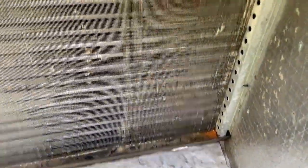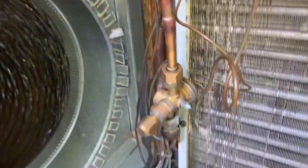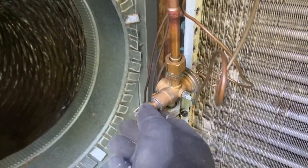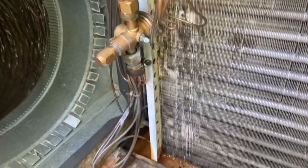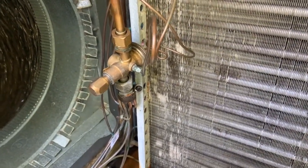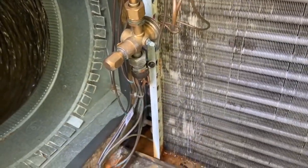At least I'm going to take the top off to get to that part. I'll brush down the condenser coil — it's actually really, really nice. Go through the whole area, make the rounds. Looking at the evaporator coil, it's really clean — I brushed it off too. Up top we have a freeze switch and a dryer; I added the freeze switch. There's a TXV, and that nut on the bottom lets you know it has adjustable superheat. If superheat and subcooling are out of whack — both too low or both too high — you can adjust this to bring it into order.